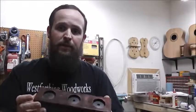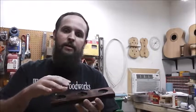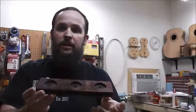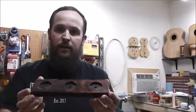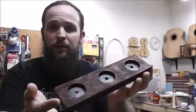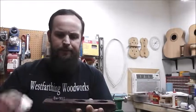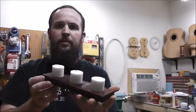Basically what that did was remove the stain from those areas, but it left it down in all the cracks, in the deep spots. After that, I came back with a brownish, orange, almost burnt-looking kind of color stain. That stained the areas that were lighter, so you get that contrast effect — the dark in the valleys and the lighter color on the peaks. It's a really easy process and a lot of fun. You can get a wire wheel just about anywhere — most Home Depot or Lowe's and hardware stores carry it. I threw a couple of little candles on it and ended up putting it on the kitchen table.